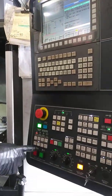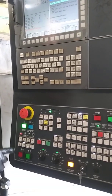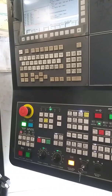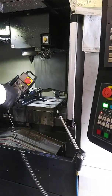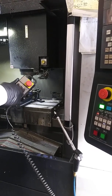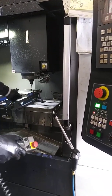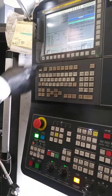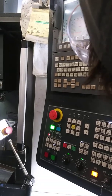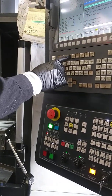So now I'm gonna go into - which one of these buttons will look like manual? What's manual gonna do? What's in my hand? The handle. Z, 10 thou. Got my piece of paper, switch to the 1 thou. I'm good. See this dumb ass shit? When it does that, just hit reset. If you gotta go up or down too fast, it fucking loses out. So when I'm here - good. Now I go into settings.